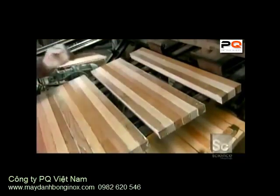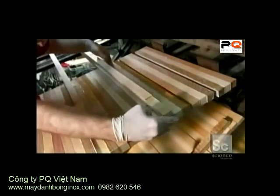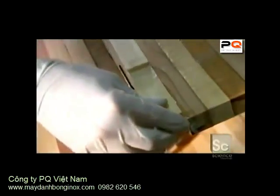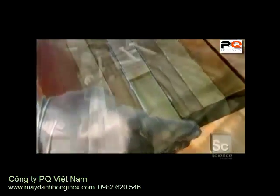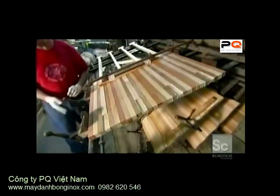The blade chunks are arranged in a much bigger clamp. Then the glue-coated ends of some shafts are wedged between the blade pieces. In a process called lamination, the blades are bonded to the shafts. The laminated paddle shapes are called blanks.